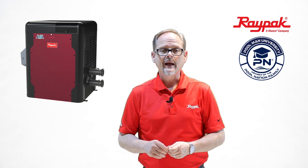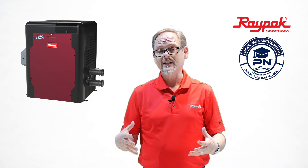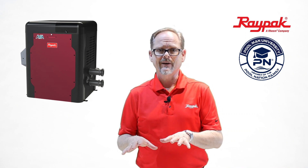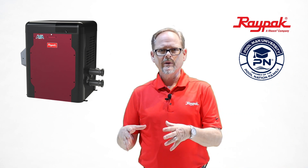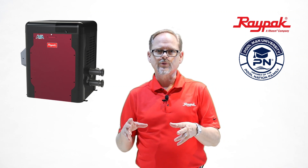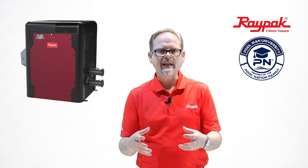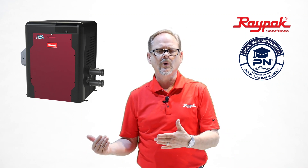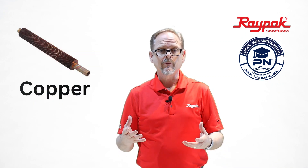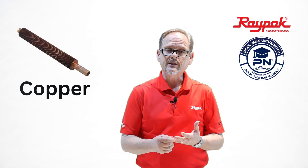One other thing that's available as an upgrade is our heavy-duty model that contains our NITEC heat exchanger. NITEC is what makes it the heavy-duty model. In the swimming pool industry, when we heat water by running the swimming pool water through pipes and then burning a fire above or below those pipes to heat the pipes, the water takes that heat back to the pool. These pipes are typically made of copper. Copper is a great metal to use for a heat exchanger — it absorbs heat well and releases heat well to the water.